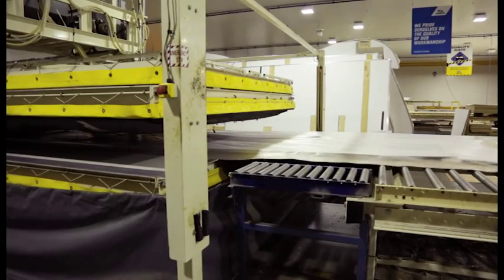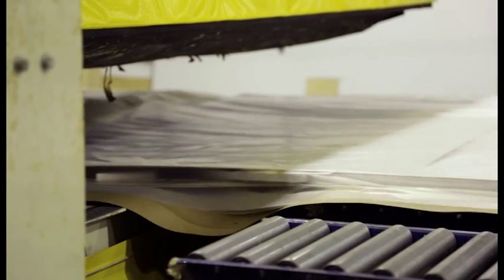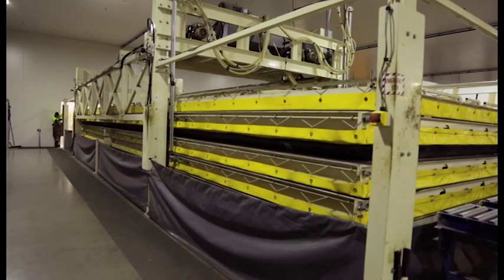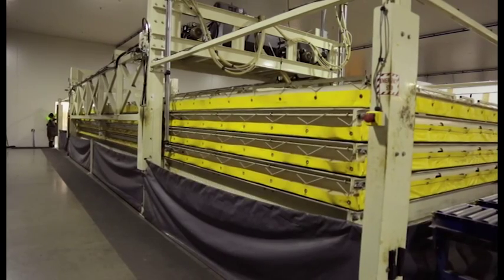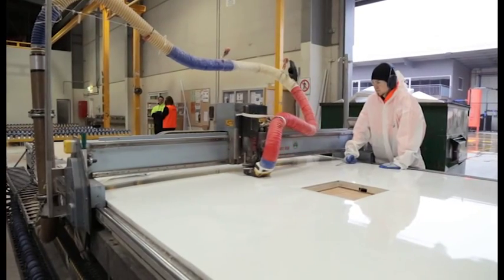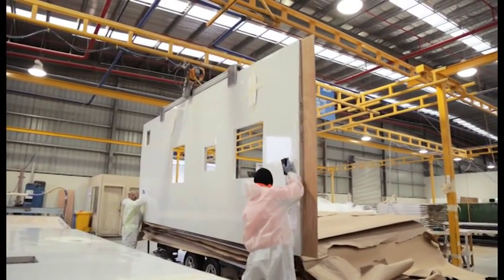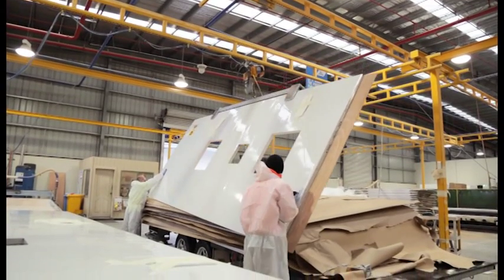Once the sandwich has been assembled, it's rolled into one of two vacuum presses. Jayco workers have nine and a half minutes from the time they lay the first layer of glue until they get the piece into the press. The press takes about 25 minutes to bond all the layers together and create the Tough Frame. When the wall or roof rolls out of the press, they are stacked before being moved to a router where a CNC program cuts out all the apertures for the windows, doors, roof hatches and air conditioner. They are then stacked again, ready to be moved onto the production line.